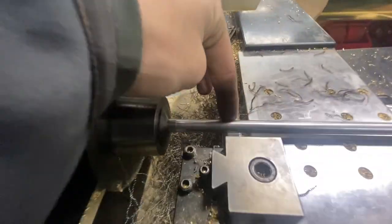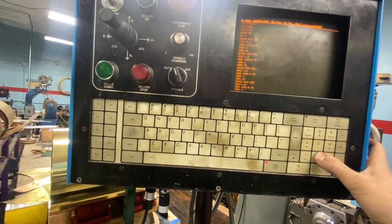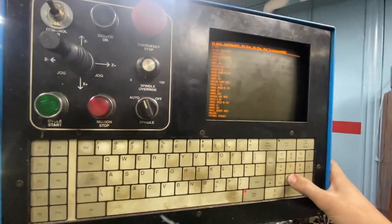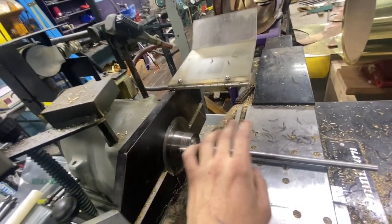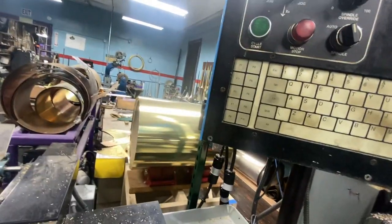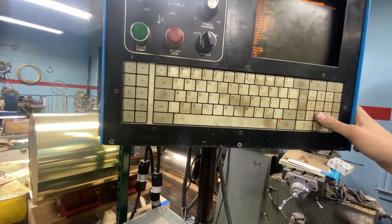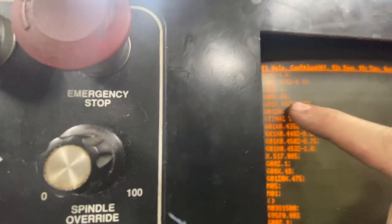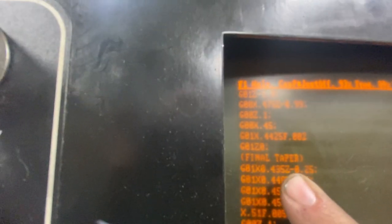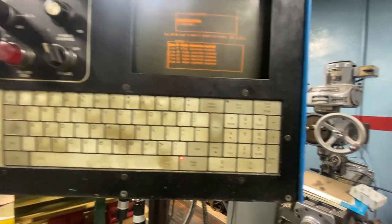Yep, that's right. Beautiful. We roughed out more than we needed to, but that is awesome. So all I've got to look at is this weird dish. Let's go into F3, escape. I bet there's just one digit off by like five thousandths. It looks like it was the third pass. That's a freaking mouthpipe mandrel. We did up to where it hit the bore, which is 460 on this one. I would take this on my manual machine, put it between centers, and machine the rest manually - which is like four inches at the 460. Something was wrong with our taper on the last one - we went 435. That was a big step. Our starting point for the taper is 442, and our first digit is 435 - it should be 445. So it dipped in seven thousandths. But that's it. That is awesome.